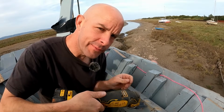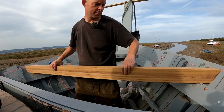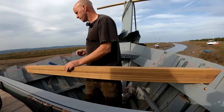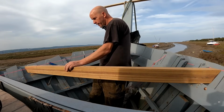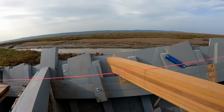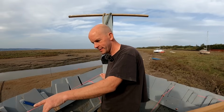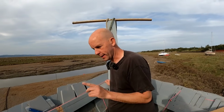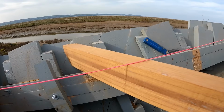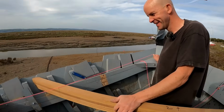So this isn't our final cut. Just sort of, yeah. What was I saying off camera? It didn't need to come down as much as it needed to. So we measured 10 mil at the string line earlier. That's how much it was saying to remove, but I said I bet it's double that. And it's not still, see? Yeah. So we took 10 mil down. And it still needs to come down. Yeah, more. Gemma went, that doesn't make sense. It doesn't make sense to me, but my little brain is telling me I need to take more off it. Right, keep nibbling away.